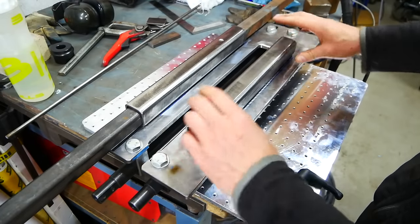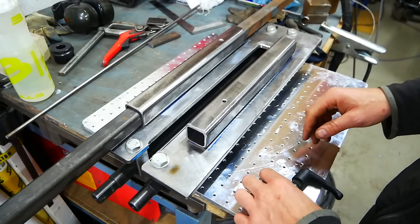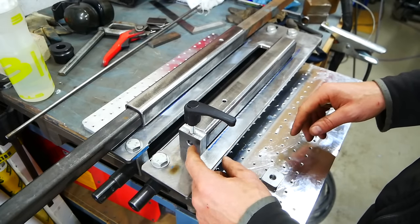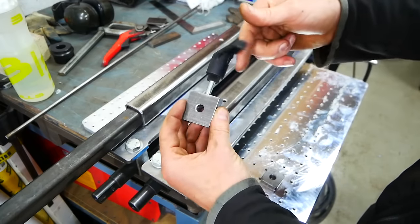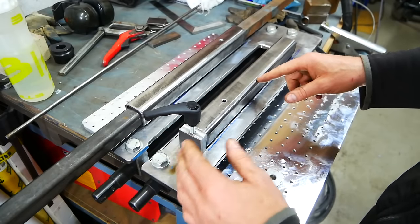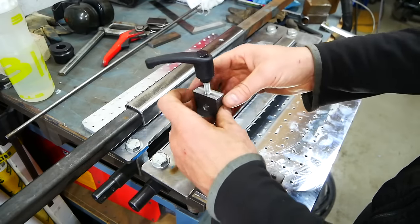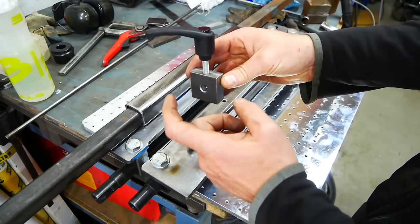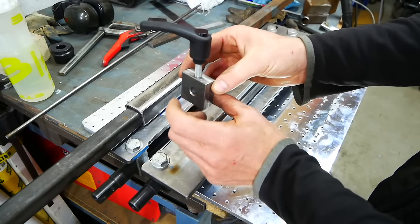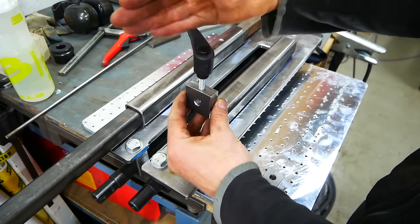So I will weld this one on the frame. That's strong enough, gives enough side support, and I also made these with the hole and lock. I will use that for a pointer to help me align the bead. You'll see that used later, but this pointer needs to be nice and strong, and only holding it on one hole might not be stiff enough.